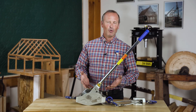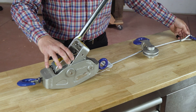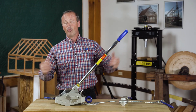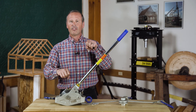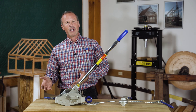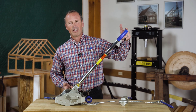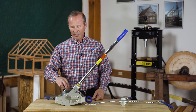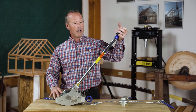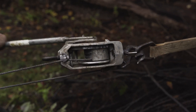How is this able to get two tons of pulling force? The way that you get a ton of pulling force out of the come-along is due to the mechanical advantage of this handle and the diameter of the drum. If you've ever ridden a bicycle with cranks of a certain length and multiple gears, you know there's a real difference between first gear and 18th gear on your mountain bike. This is sort of the same thing — the handle represents the length of your crank on the pedal, and the drum represents the gear, allowing us to apply significant mechanical advantage and pull with 2,000 pounds of force.